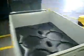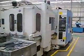Also, the clamping unit, I was involved in that. I installed a Millennium Crouzet PLC in it to do the clamping of the parts. We are clamping Cummins gears on this machine. This is our very first Makino. It's an A55D from 1993.